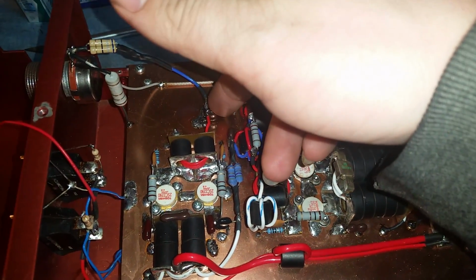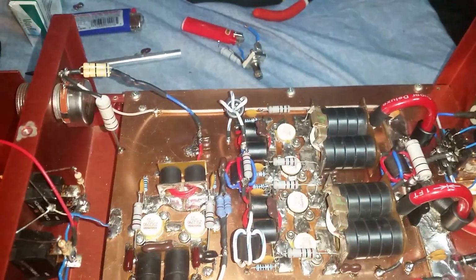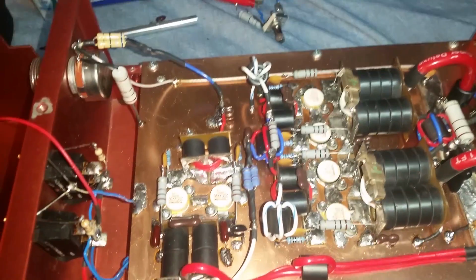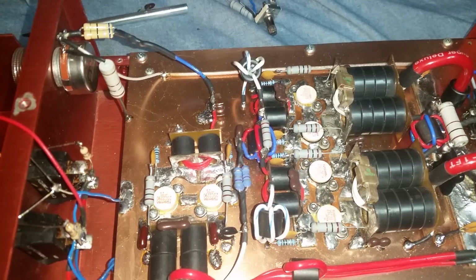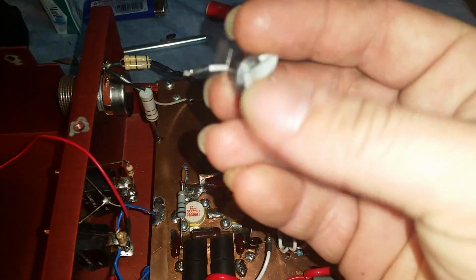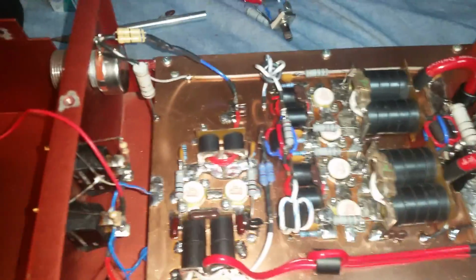So I pretty much did about three different things. One thing is I went ahead and took all the input tuning cap off and threw a trimmer in there. I tuned that out, and it did tune out lower than what was in there, about 104 picofarads. So I put that in for you there. Another thing I did was take the input choke off the input transformer. That bumped the dead key down a little bit, and that did not take anything off your top end as well.